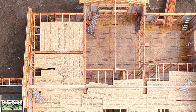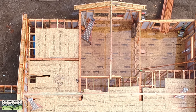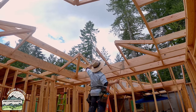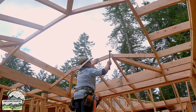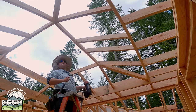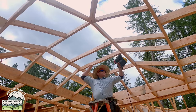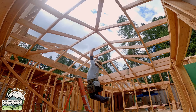The ridge beam lands on a beam that connects all the beam point loads, which trace down to the footings. Kyle was off for the day and everything was too heavy for me to do alone, so I framed the master bedroom ceiling — a hip tray, easy one-person work. All the components — rafters, hips — are pre-cut on the ground out of two-by-four and then measure-to-fit in the upper part of the ceiling. It also gave us a nice spot to balance our big two-by-12 24-foot rafters.